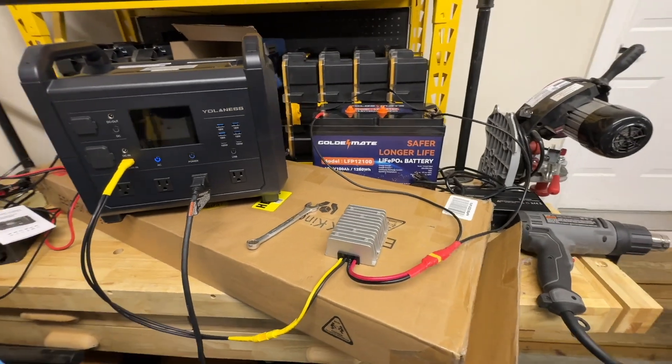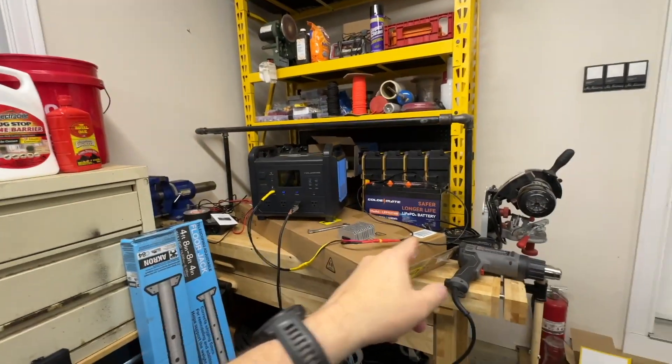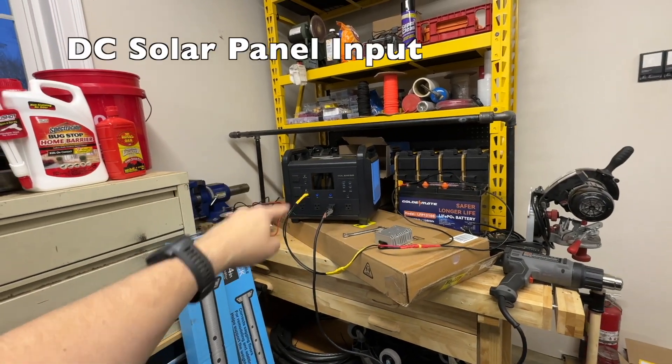Basically, the idea here is if you just took the battery at 12 volts and plugged it in, it's only going to discharge to an equal point — it's only going to go down so low. When you're putting this input voltage in, it needs to be at a higher rate to push it in there and for the solar generator to read it as an input. So what you do is convert it from 12 to 24 volts, and that takes all the energy out of that battery and pushes it into the solar generator.